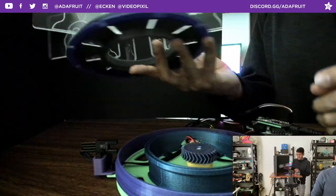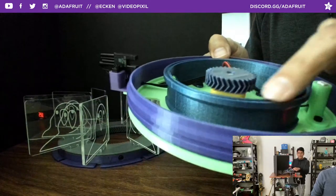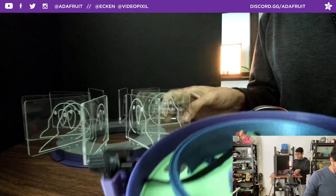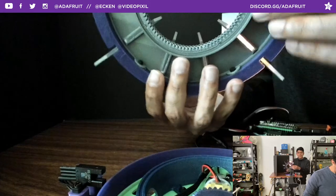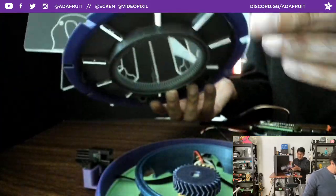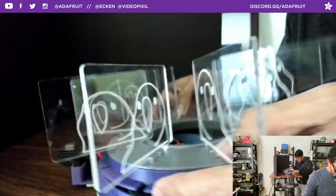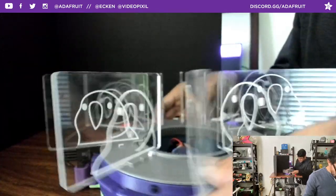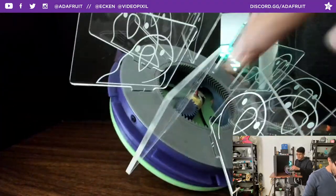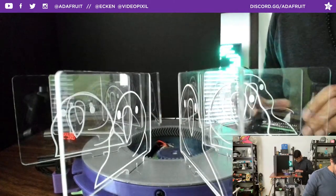All the acrylics just get press-fitted into slots on the top cover. The base holds the motor and the cover is the rail. There is a little lip that slides inside a groove in the top cover — that's really how it works. Add a little bit of grease to the rail and groove and it works pretty well. Once the gears engage you're ready to try it out.